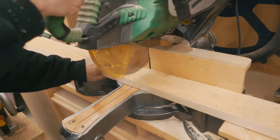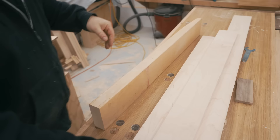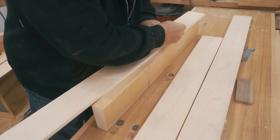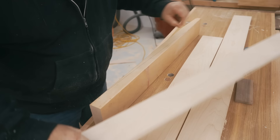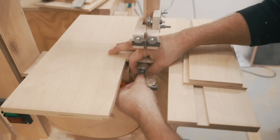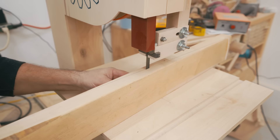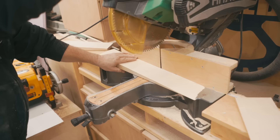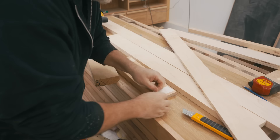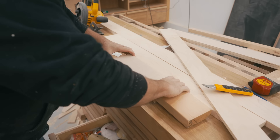The pieces that he's cutting and planing here are for the top of the opening — they're just plain and flat. But once again, he'll be making another part to add to this to add detail. He's got a piece of solid maple that's an inch and a half thick and four inches wide, and he's laying a strip on top to draw out a taper across. These are going to be decorative pieces that'll go up in the corners and they're wedge shaped. He's changed the bandsaw blade from a quarter inch to a half inch to make that cut through the four inches of maple. He does the cut freehand, then takes it over to the miter saw to trim off the ends. Then he's double-side-taping the parts together and running them through the planer to smooth out those bandsaw cuts.